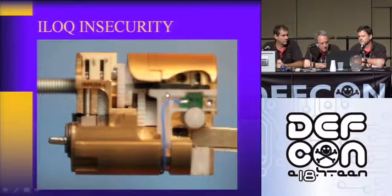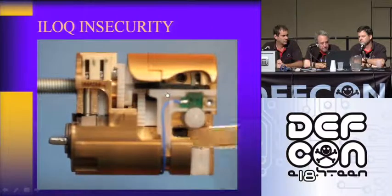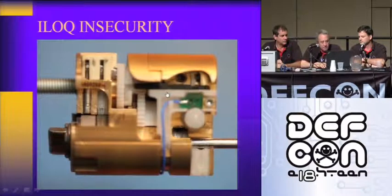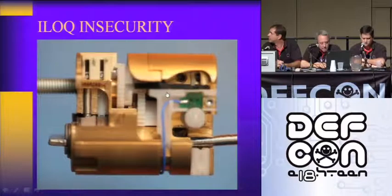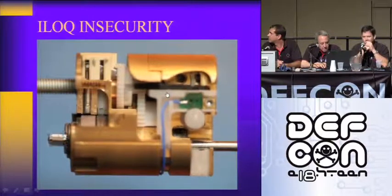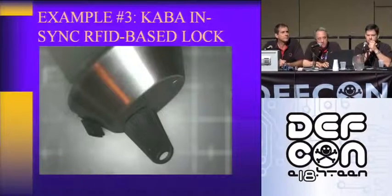We'll demonstrate — here's a simulated brass key that opens this lock. And again, a screwdriver can be used to lift that little nylon pin, which will in turn lift the metal pin that moves out of the gate of the locking cam and allows it to turn. It's a very, very clever design, but as you can see, they never ever contemplated this really simple attack.